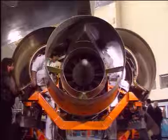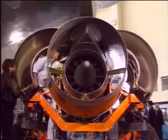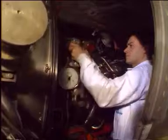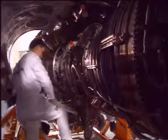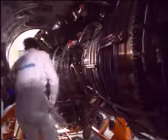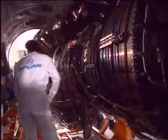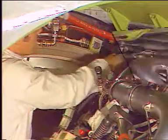Note that you never use the same bolts. Always change them for new or inspected ones. When the engine cradle is on the trolley, remove the 4 chain pulley blocks and dynamometers. Then the bootstrap equipment. Reconnect all lines and electrical harnesses to the pylon interfaces.